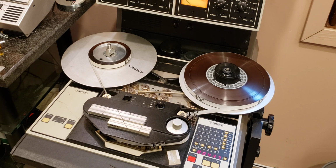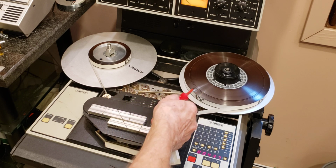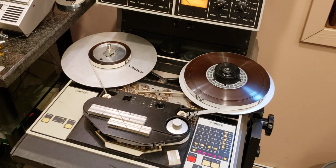Now about the problem. I have some suspicion. I think what happened, you see the bunch of those output transistors, and I believe those 4 here belong to the capstan power drive. And if I'm right, but I need to do more troubleshooting and investigation, they may be overheating just a little bit from this particular heavy work. Looks like it's running fine with the panel removed, which would be another indication that it might be overheating. But it's too early to say.